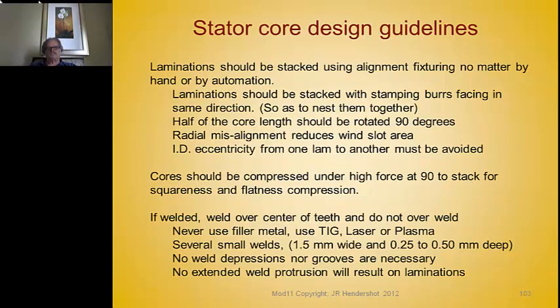The sheared edge is not straight — it's at right angles to the side of the lamination where sheared, then tapers where it tore. That torn material becomes the burr. The more clearance between the punch and die, the bigger the burr. Those burrs, when nested together, cause eddy current losses. So when burrs get too large, the dies have to be taken out and sharpened — that's a manufacturing point that must be paid attention to on the plant floor.